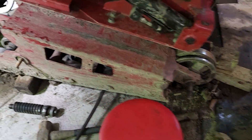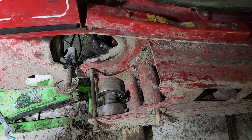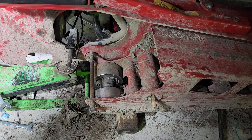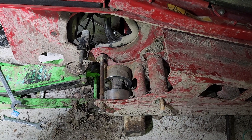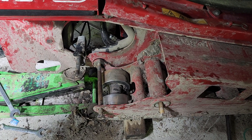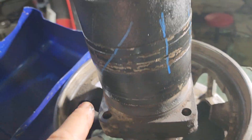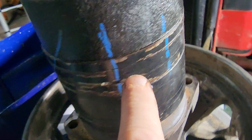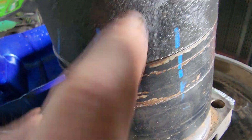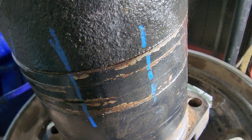That's a work in progress on this repair. Once you know what you're doing, it's somewhat of a difficult job. But if you mark everything down as you take it apart, you should be able to get it back together. When you have your motor, make sure you're putting alignment marks on there so when you reassemble the stack, you've got it perfectly matched up.